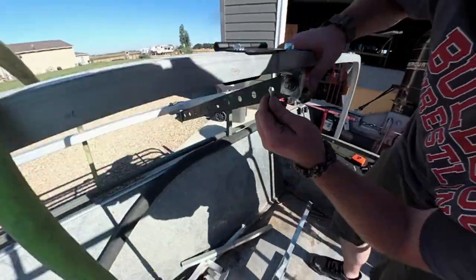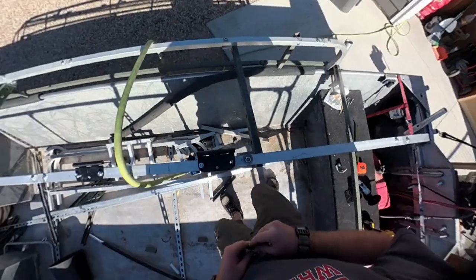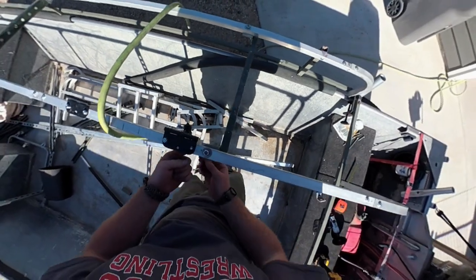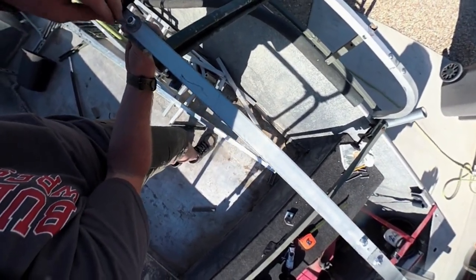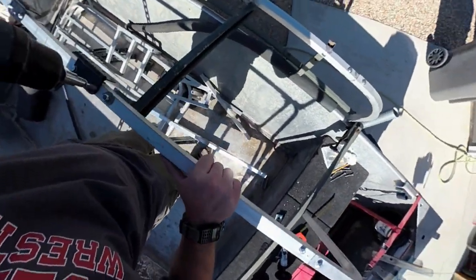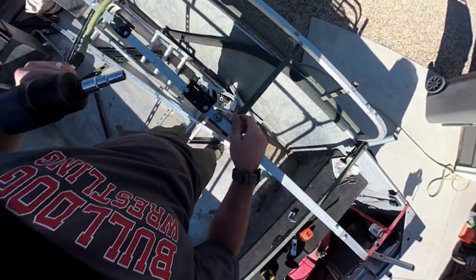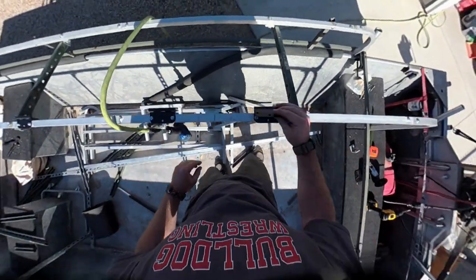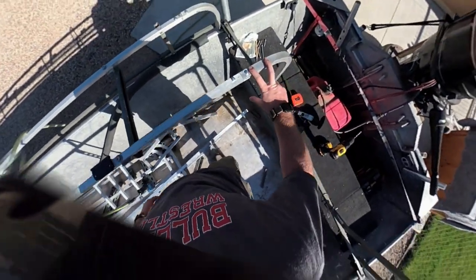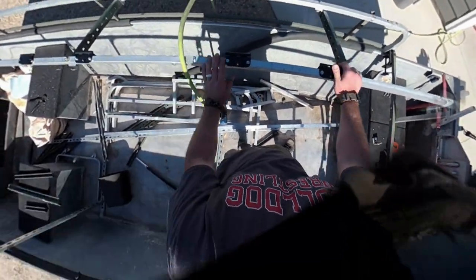All right. Take my other bolt, bust off the burrs on the bottom here. Bolt comes up through the hole, nut attaches, ratchet it down. Right, just like that, plain and simple. Hinges on, okay? 3-inch gap, 4-inch gap. These are my 1/4-inch marks here. So all I have now is to put one more over here, and I will be finished with putting on my hinges, and next comes building the doors.